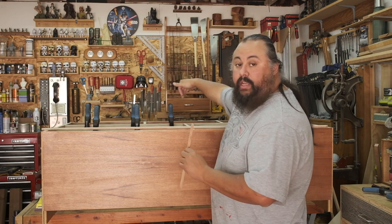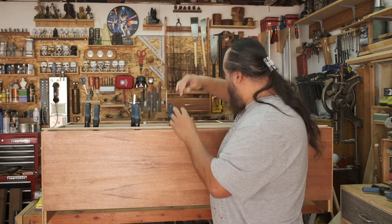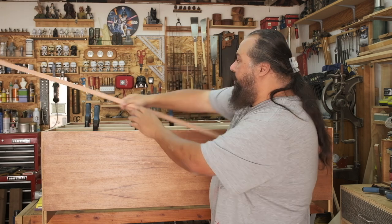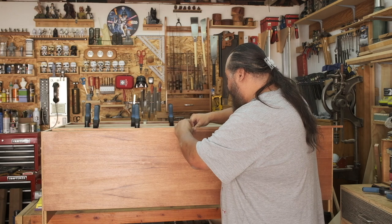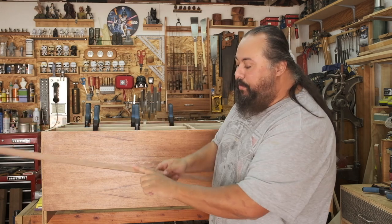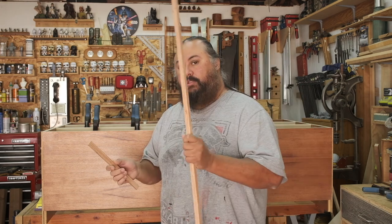The middle dividers and the up and down dividers are cut to a quarter inch thick edging, like this. And then the bottom piece and the top piece and the side pieces are all at an angle. And so that angle, the small part ends up at a quarter inch and the top part ends up at just over a half an inch. Let's start putting on the edging.